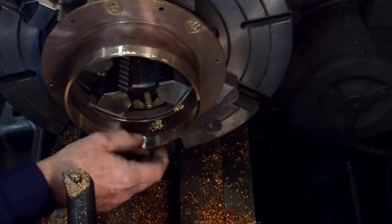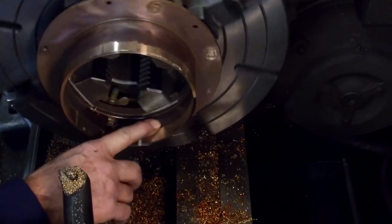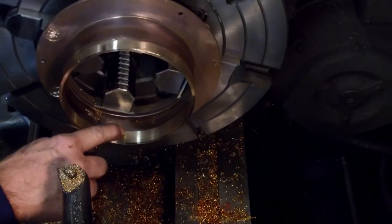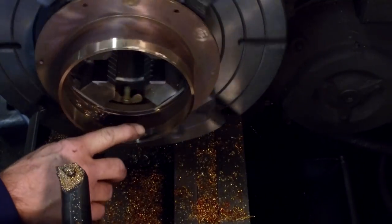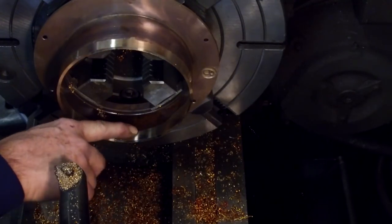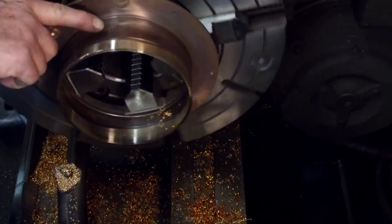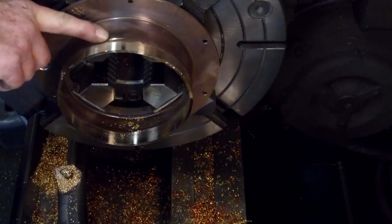This brings it in, and even though we have run out and everything else, you saw that we had highs and lows in here, but I averaged them out, four jawed them. See, there's a high, there's a high, there's a high. You can see there's a low. That's where it's back here at the original line right here. Okay, and that's where we said that was a bump. There's a bump out here. See, that's where it was touching out here.